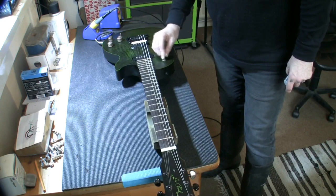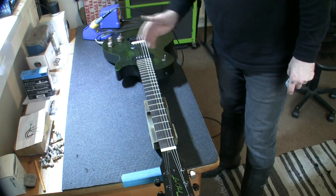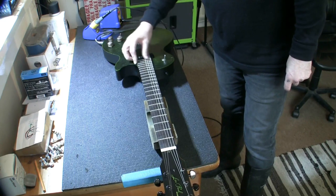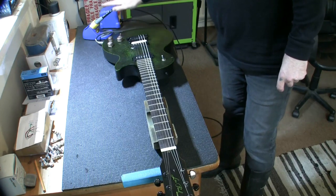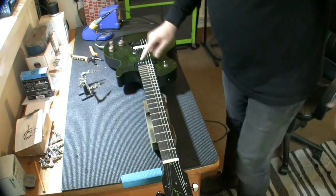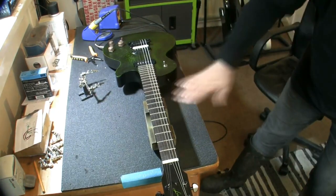So to show where the kill switch is at the moment — on, off. The owner wants that to be on and this to be off. So I'm going to swap the two outside wires and see if that does the trick. The soldering iron is warming up — nice Hakko solder station back there. And there you go — what the client wanted: down position on, up position off. Not a difficult job at all and it's all done.